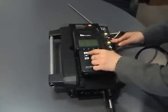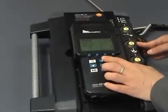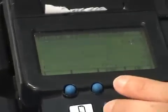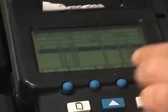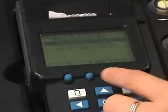To configure the instrument, press the book icon — the configuration menu comes up with options for memory, sensors, input, device and service. Under memory there are four functions: read out, program, delete memory, and it shows free memory. To read existing memory, press OK on read memory and the dates of recorded measurements will appear. Pressing OK on one shows the list of parameters taken at that time. Press escape to exit.